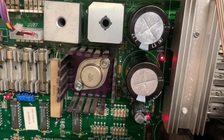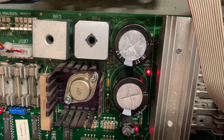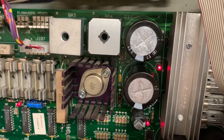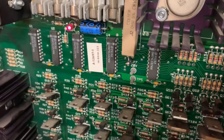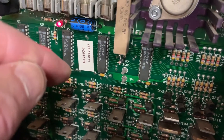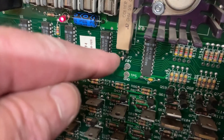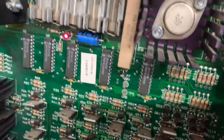I replaced C5, as I usually do for the 5 volt circuit, and C11. C11 was a little domed. I don't know if it can happen on Getaway, but it can happen on Whitewater where if you get the connectors backward or in the wrong place you can damage C11. So I put this diode in here on the end of this big sand resistor, and that prevents that from happening any time in the future.